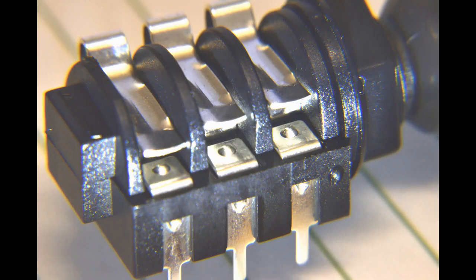Here is a close-up of the socket with no plug inserted. There is contact between the pins on one side to the pins on the other side. However, with a plug inserted, these contacts are broken and you can just about see the pins on the near side, as seen in this picture, do not contact the conductors on the plug. Much to my surprise, I didn't see any mention of this in the technical literature in relation to this audio jack. I know now.